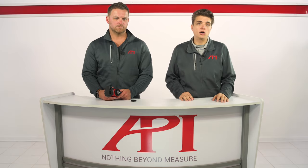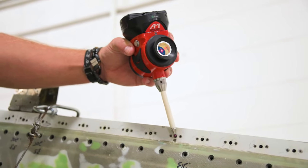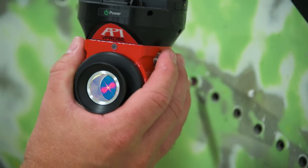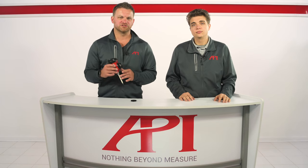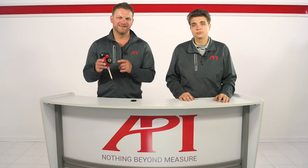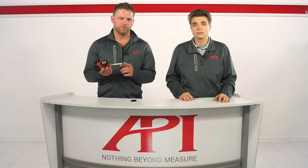It's these stylus locations that start to separate vProbe from a traditional SMR. vProbe takes the tracker's laser into its mounted SMR and reflects the beam back to the tracker from the center point. But unlike SMR-only measurements, vProbe itself is performing calculations throughout the measurement process. These calculations are necessary because the tracker is not measuring points at the center of the vProbe's SMR.